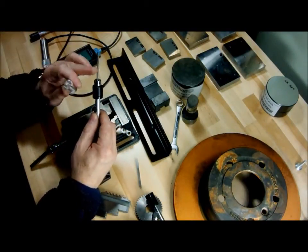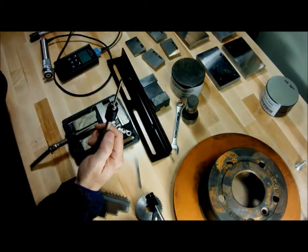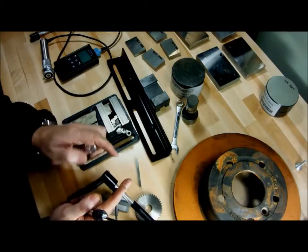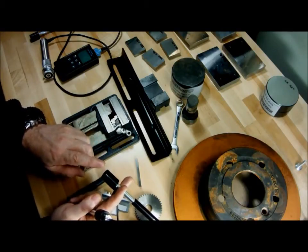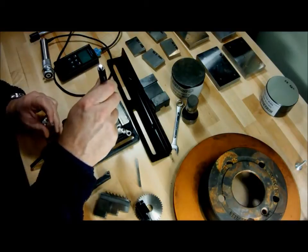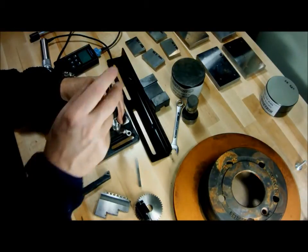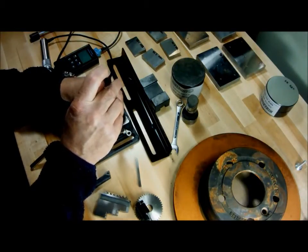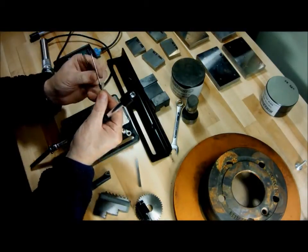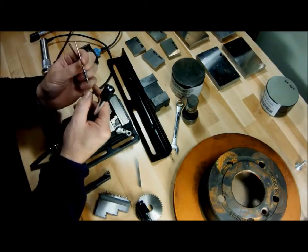DL type — quite unusual because it has a very thin nose. This is used in areas like a gear or the root of a groove where the face on the regular D type probe — the standard or universal — cannot fit, because the probe has to be sitting neat against the face and must be perpendicular to the part. In a case like this where I'm wanting to measure inside a groove, it can get down inside and by sliding this little guide over the top it allows us to have it positioned quite accurately, load it, fire, and we can measure. It's a very thin probe with the same gripper mechanism, carbide ball, and high-precision machined probe.